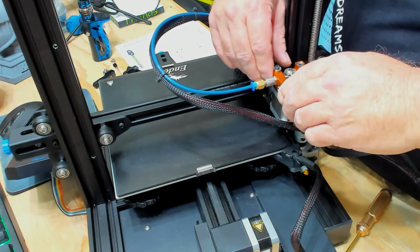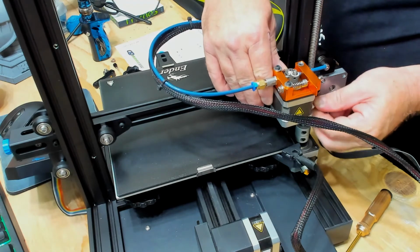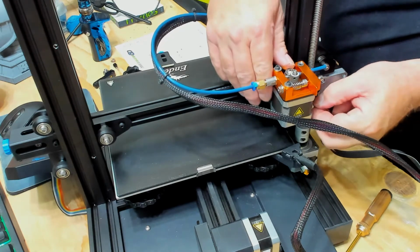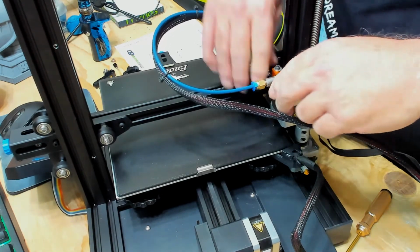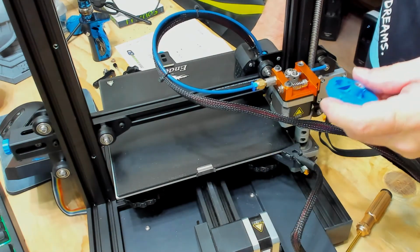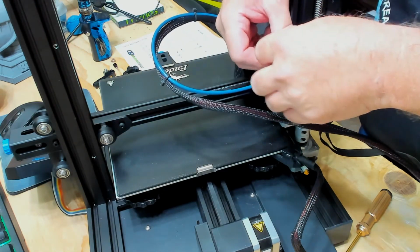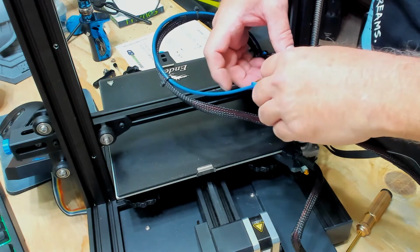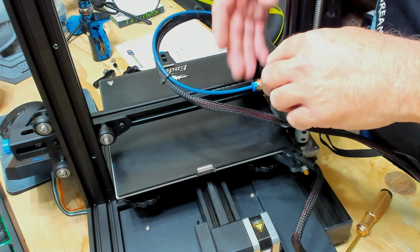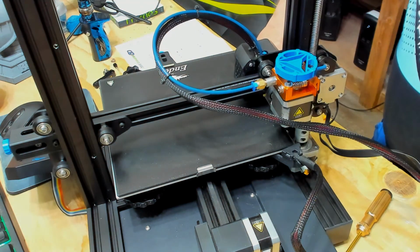So that's perfect. Hook up your stepper motor again, which I didn't have to disconnect, but since I had it in my hand, moving it around, you don't want to rip your cord or break it. That's why I disconnected it. So we'll load some filament up, or after the video's over here, I'll load up some filament. Put your wheel back on. I will go on the slicer and I'll set it back up to 95 on my extrusion multiplier in S3D, and I'll be good to go. But based on what printer you're putting this on and what slicer you're using, you have to refigure your E-steps.